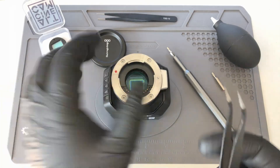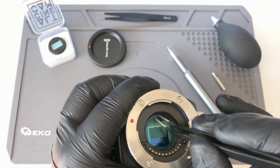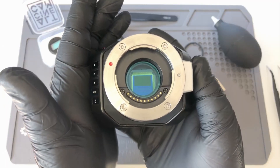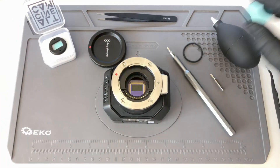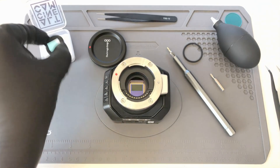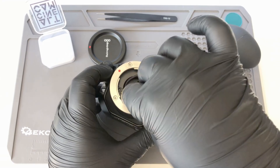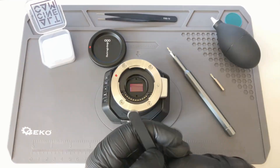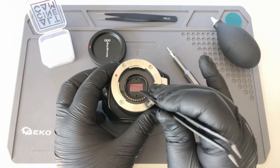You can take your tweezer and as you can see there is an o-ring around the original IR cut. You're gonna grab onto it and pull it out. The original IR cut should be free, and with a quick movement you're gonna flip it upside down — and as you can see it will remain in your hands. Put it aside. Grab our filter and drop it inside the hole. Now you're gonna take the o-ring and just push it inside around the filter. With the back side of your tweezer you can go around the o-ring and make sure that it is pushed back to its place.